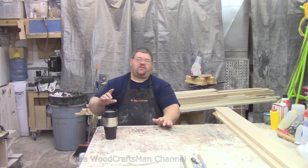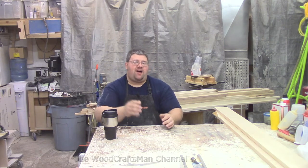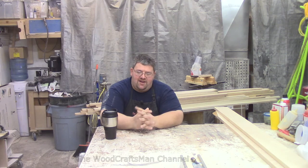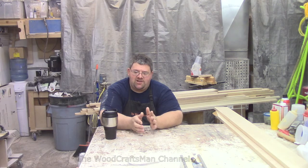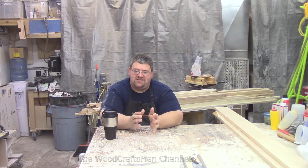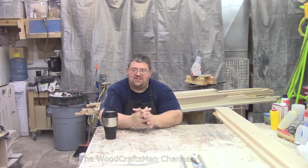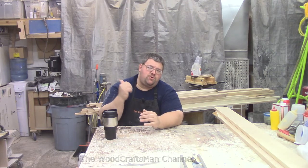Right now, my 100 amp panel in the shop is really no more than a sub panel from the main panel that's in the house. In the house, there is a 200 amp service and a 100 amp breaker that feeds the shop. Basically, what he would do is, on the back side of the house where the meter base is, install a 200 amp service disconnect there and add a second set of auxiliary lugs to the load side of the meter. That would feed a 200 amp panel on the back side of the house. From there, that 200 amp panel would feed a new 200 amp panel in the shop here.